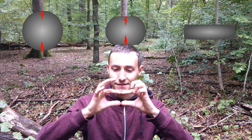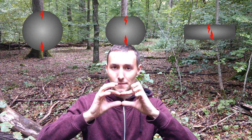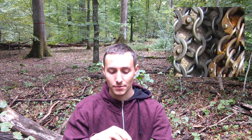If the ring is flat, whatever weakness is on the surface is very close to the core, meaning the ring could crack or be torn open. So round rings are better in that regard. Even on round rings, the overlap where the rivet is does become flat, and if you've worn mail a lot you'll see rust building up on that partially flat surface — the other rings touch it less, so rust stays and is not rubbed off. Hence, round rings are stronger and prevent rust better.